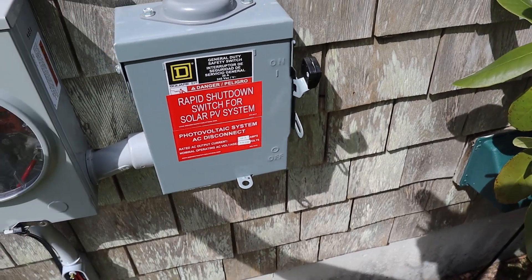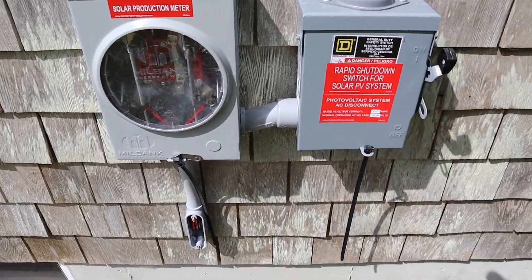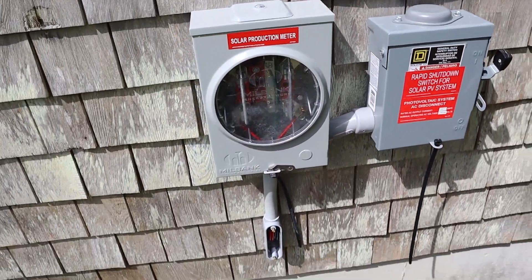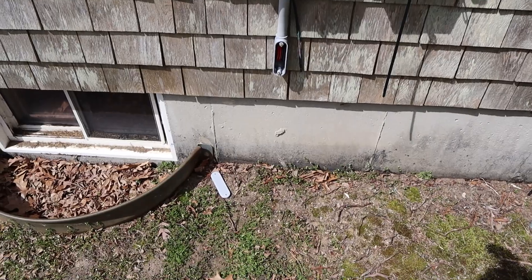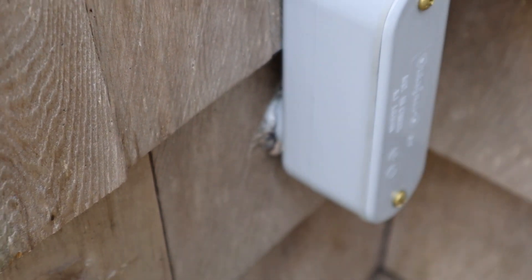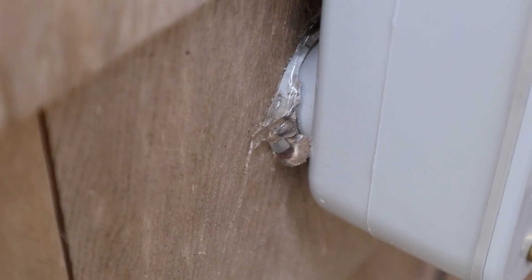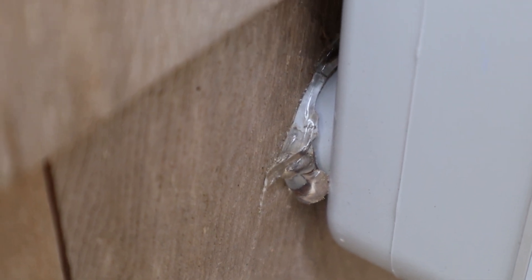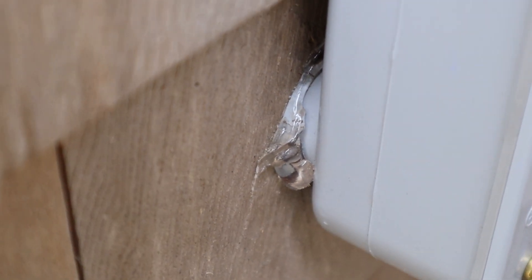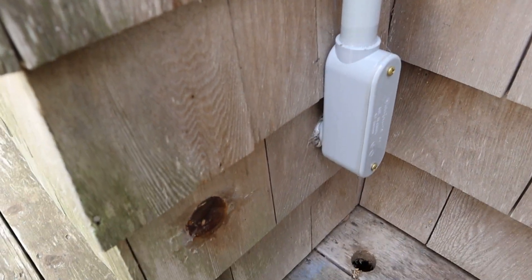Stickered and properly labeled — we just had our inspection so that's why we don't have our zip ties on just yet, but we're going to zip tie these up to make sure nobody can walk up, touch them, and get hurt. Also, with these conduit bodies or LBs, in addition to sealing the inside to make sure there's no airflow, we also seal the outside to make sure there's no water intrusion into the wall cavity getting in around our pipe. That's what we do there to ensure quality in all aspects of the installation.